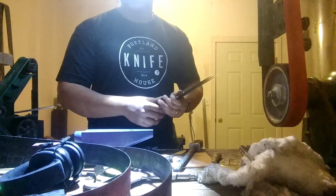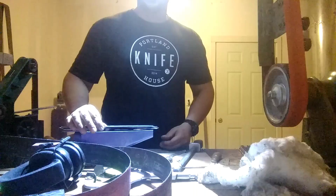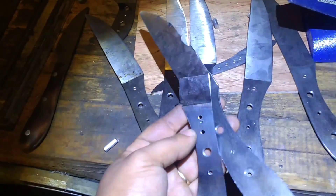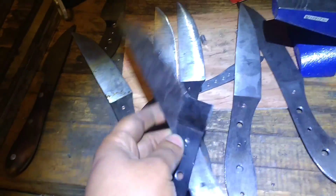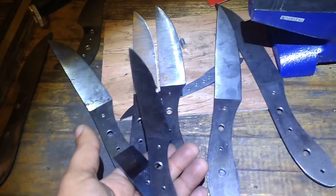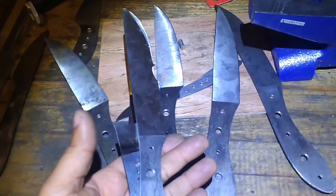Metallurgy is much more of a practice than an exact science. We got five blades that survived — the rest did not. I would have enjoyed using the ones with that thin geometry; the cutting quality was great. But I have to test to see what the limits are — I can't just send stuff out without knowing. You have to break it to find the limits. The nine thousandths cutting geometry at 15 degrees per side cut like a champ, but it won't handle any extreme hard use.